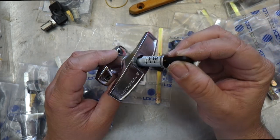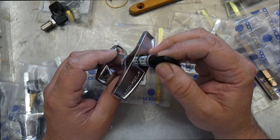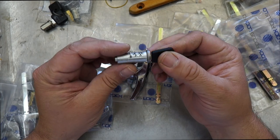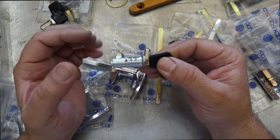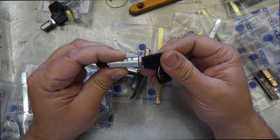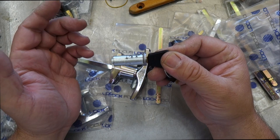That's what removable barrels are all about — easy replacement. On this particular product, if you buy one and find the barrel is out, what I like to do is pull the key out about five millimeters, not all the way. If you pull it out all the way, the discs can go shooting. So pull it out about five millimeters, depress that last retainer in, and push the key back in.